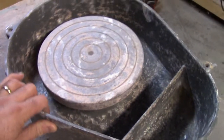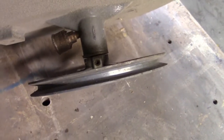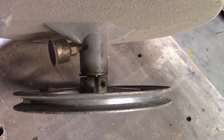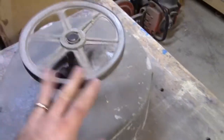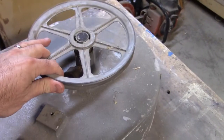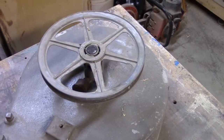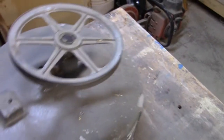Now this wheel is interesting. I don't know how old it is and I'm not even sure who makes it. This wheel doesn't have any bearings - what it is, the shaft sits in a brass sleeve and you put grease in it, which is pretty cool. I think once this wheel is all up and running with some fresh grease it's going to be quiet - very quiet. I took it all out, it's all clean now. There's no grease in this, that's why there's a little bit of slop. If I get some good grease and pack it in, it'll be a pretty quiet wheel.